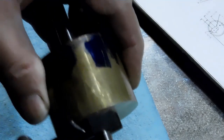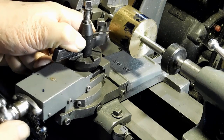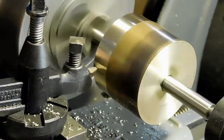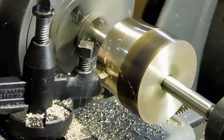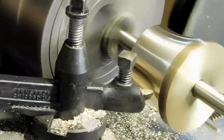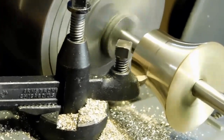There's a big piece of brass on a drill rod arbor, ready to be made into a fusee. Now we've got it on the lathe and we're setting up the compound to cut that curve — we need to cut a curve, so it's a little different from your normal way of working. That bit needs to cut in both directions. You really have to watch out not to heat up the brass too much, since it's held on with Loctite — you don't want that Loctite to let go. Now we're getting near our final curve.